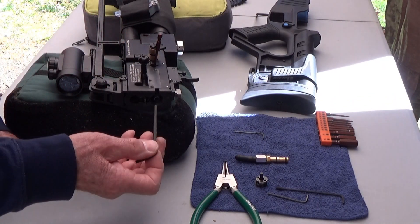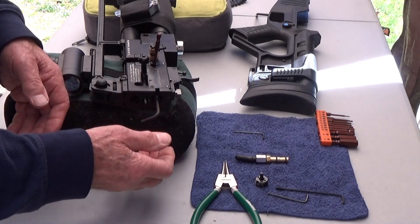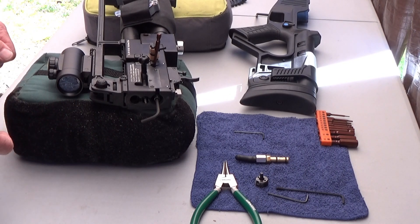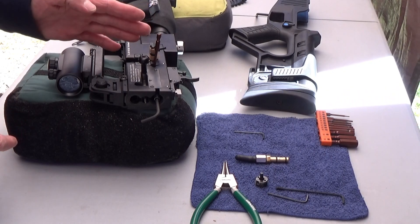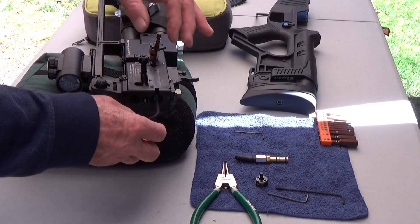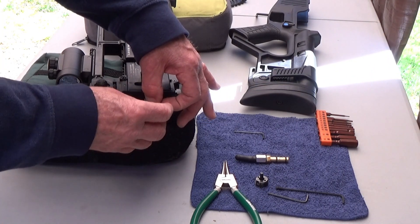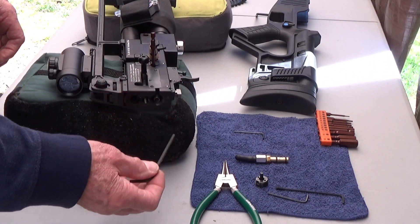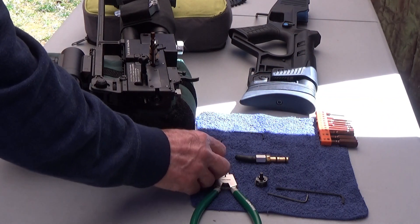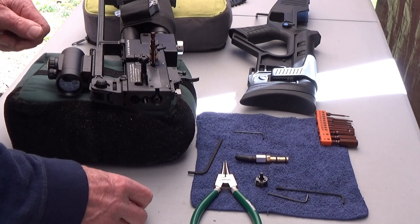The number four Allen can go in through the spring, and we're gonna lock it in. What I'm gonna do is turn counterclockwise — that'll bring this spring back and compress the spring more, which gives you more power. I'm just gonna go one turn. I've already turned this a couple of times before, so just one turn on that.